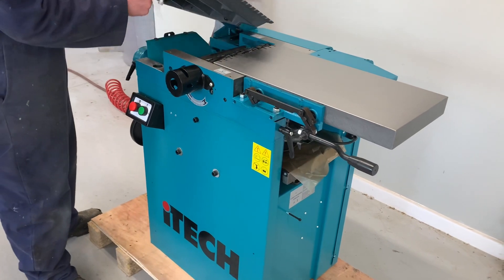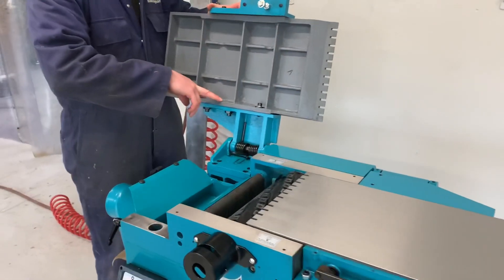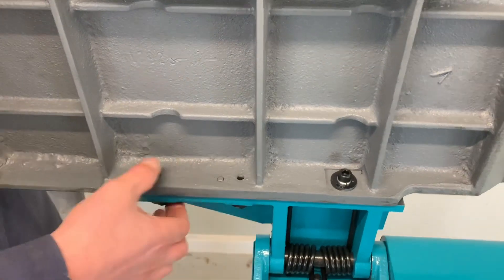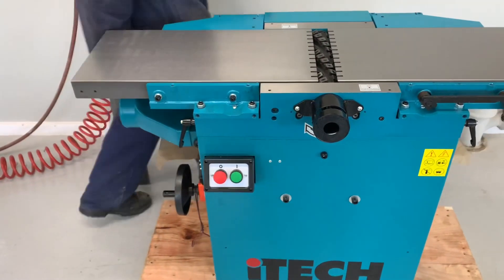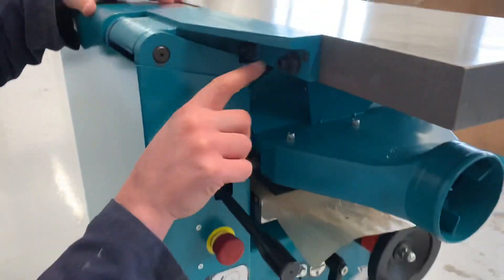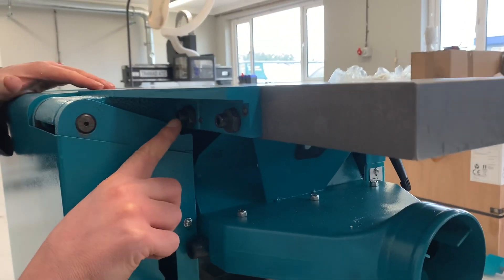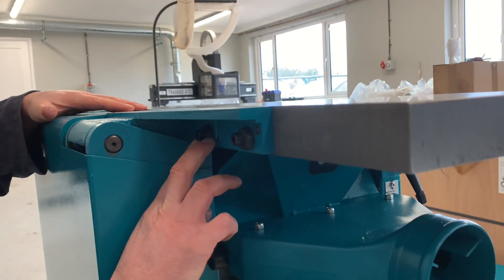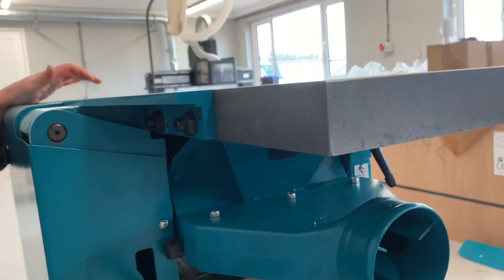Now we want to adjust just this one. If it's just the datum that we need to set, it's factory set with the pins — there and there. You may need to remove one. If it's a fraction that you need to remove this to get it in, there might be enough play in the pins. If not, slacken these only one at a time according to which way you want to go. I would suggest this one — slacken that very slightly and move this. Turn it because it's offset. A little bit goes a long way, and then check when it's tight again because it can move a fraction as well.